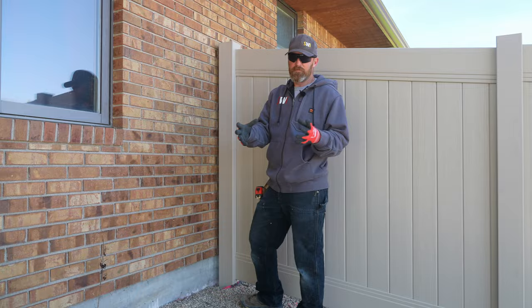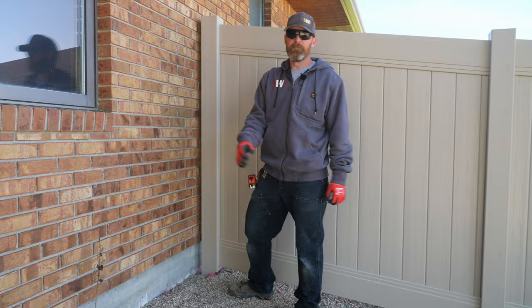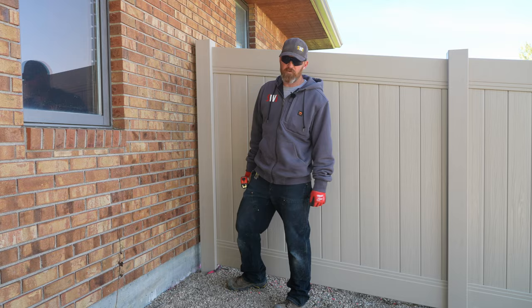This one here we hand dug it down. We did find some pretty good size rocks — you run into that sometimes. When they're backfilling a footer they take all the boulders they found on the job site and put them in there. Go ahead, dig a hole, set it in concrete or however you want to do it. One of the problems you run into fairly often is a footer, usually about two feet down — sometimes deeper, which isn't a problem — but about two feet or a foot and you have a problem.